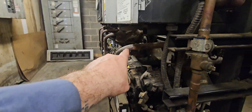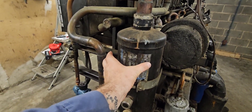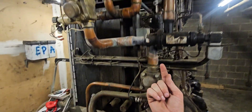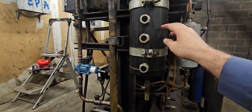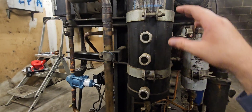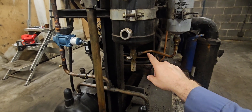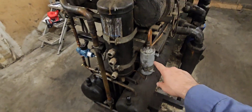What happens is the oil is going to come up our discharge line. You can see our discharge header right here — it comes in and it's going to hit a screen that's on the outside of this separator. Oil is coming in hitting that screen, and because the oil is heavier than the vapor, it's going to stick to that screen and drop. Your vapor goes up into your condenser, heat reclaim, or whatever you've got going on. Your oil comes down into your reservoir. This top side is your separator; this bottom side is your reservoir. This is a high pressure oil system because the pressure in here is your discharge pressure. On the bottom of this is your oil line that goes to your compressor. We go through an OF303T — your oil filter — to filter out the particulates. This is all high pressure, high temperature discharge.